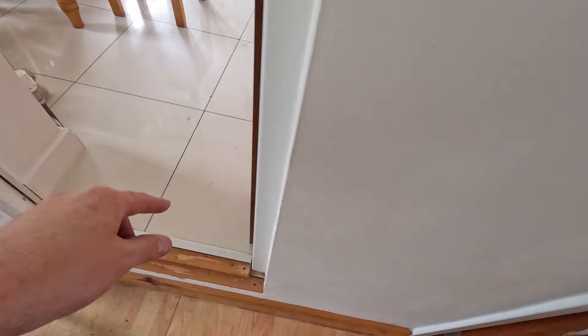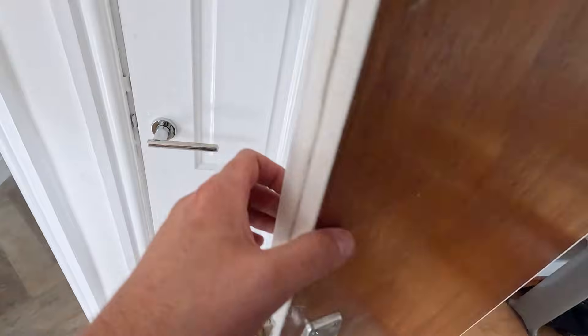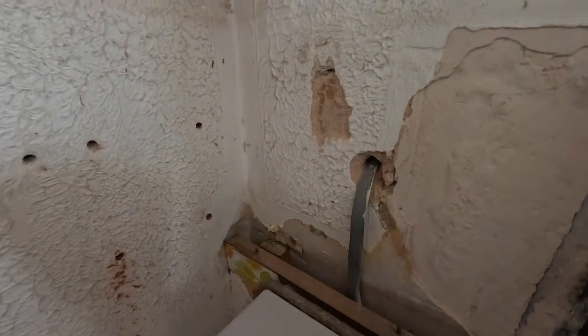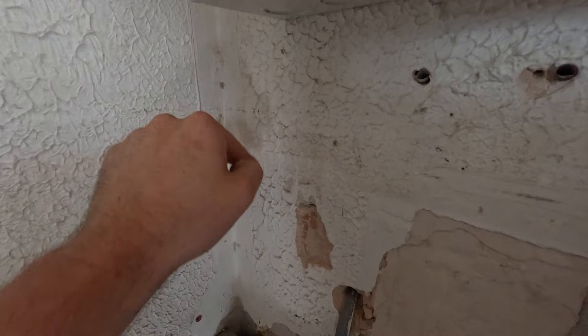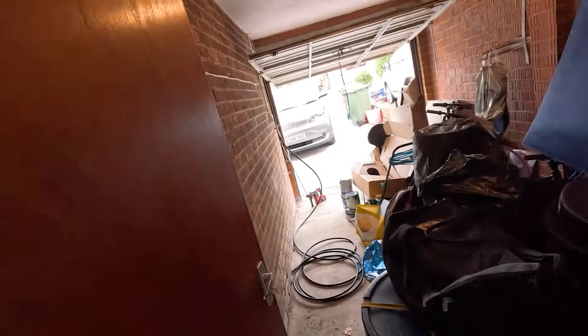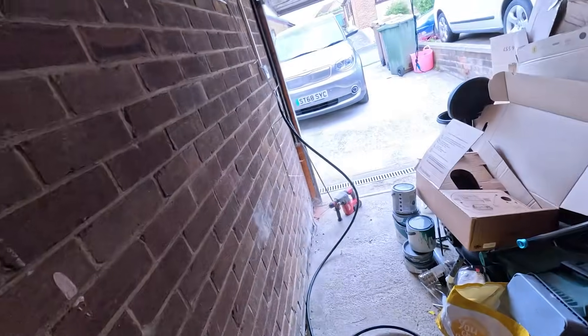This cable is going to come along this seam. I've measured from the floor to here, this floor to here, this floor to here, so that mark there — I want to drill from this side because it'll land behind the door. If I drill from the other side it'll take a big piece out. We're going to send the drill piece in nice and straight and flat and hopefully pop out the right side. If we send it on a slight angle it'll swoop in a bit nicer.